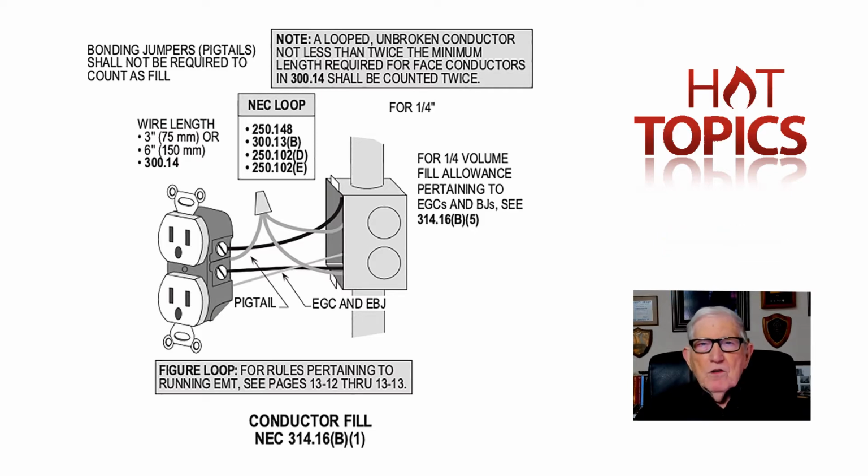12-2 in Stallcup's Electrical Design Book, Volume 1, and show that, we would pigtail, in other words, splice the neutral together and pigtail it, which we call a bonding jumper. And that way, when you removed a receptacle or fixture, whatever the case may be, you wouldn't be removing and breaking the continuity of the neutral conductor. This was where a problem came in.